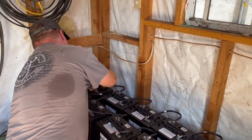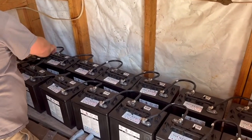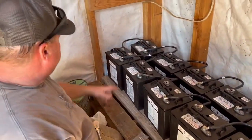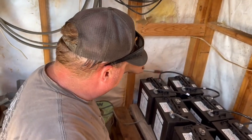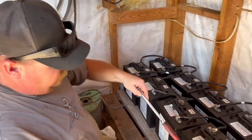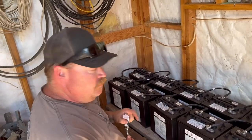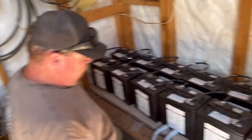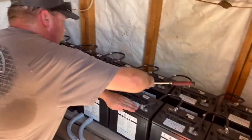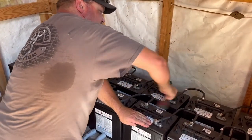William is tightening down all the nuts on the cables connecting the positives and negatives of each battery in series. He's connected the back one — positive to positive — and then it's negative to positive, negative to positive, so on and so forth. Always connect your negative last and always disconnect the negative first. When tightening these you don't need power tools, just some wrenches — I'm just using a ratchet. Just snug them up; don't wrench them down too tight because you don't want to strip it — the terminals are lead.